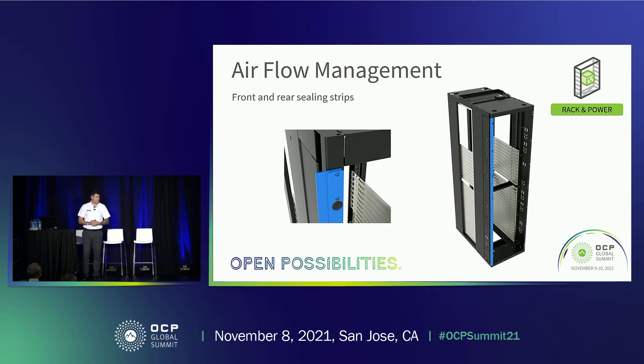Here are some topics on airflow management. You can see a seal on the left-hand side of the rack — those familiar with ORV2 will know these same seals. The difference is that ORV2 has much more open edges of sheet metal, which are ideal locations for fixed seals. ORV3's design is much more closed with fewer edges for seals, which is why we've fixed it to the very front. This is still in development because there are issues with the seal sliding left and right, which isn't ideal — so it's under review and is more of a challenge than ORV2.